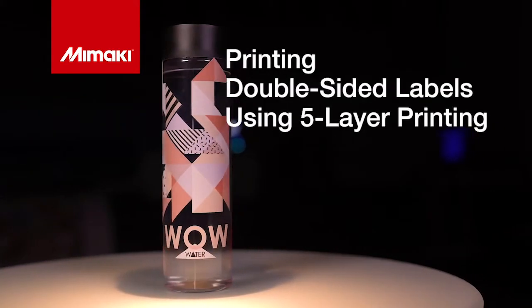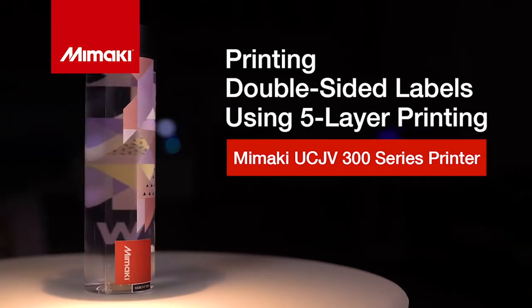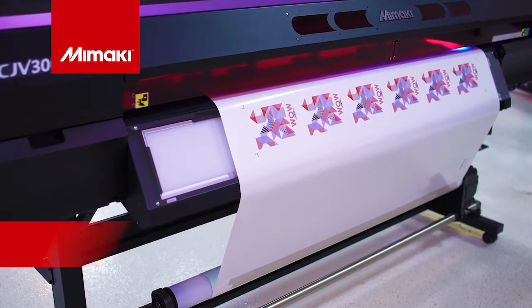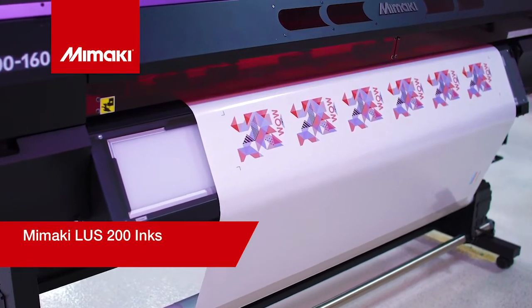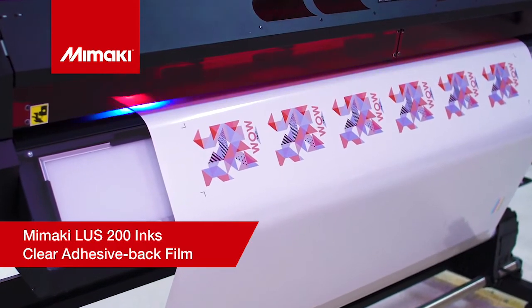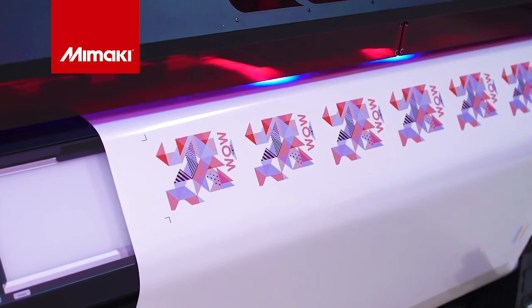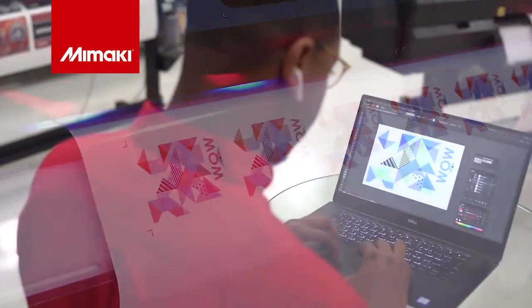Today we'll be creating double-sided labels using the 5-layer printing capability of the Mimaki UCJV300 series printer. For this effect, we'll be using Mimaki LUS200 inks on a clear adhesive-backed film. 5-layer printing can be used with dramatic effect in a variety of applications, including static clings, labels, and signage.